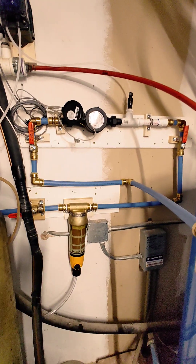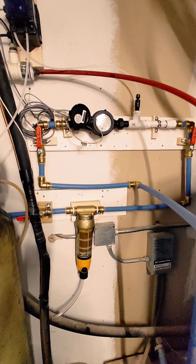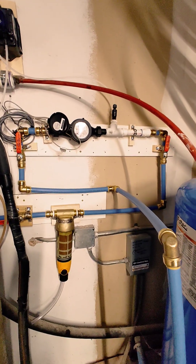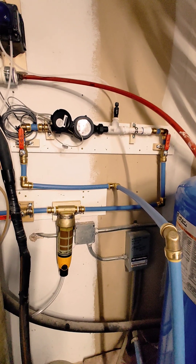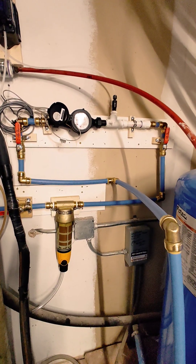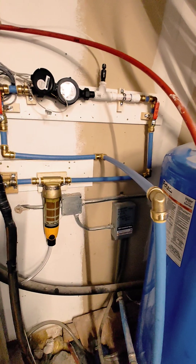The problem is the well has iron 2 oxide. Iron 2 is water soluble, doesn't get hit by filters, and my Filox system was not removing it all. You can tell you have iron 2 in the water because it goes through all the filters — it's completely dissolved — and then it oxidizes to iron 3, which is rust, and manganese 4, which comes out of solution.